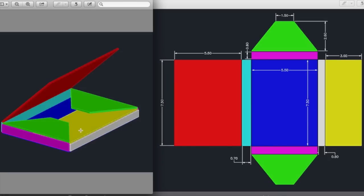There are a couple of things to keep in mind: you want the different lids to sit on top of each other when closed. The yellow lid is lowest, the green ones fold over on top of it, and the red lid folds down on top of everything. To do that, the side panels must be the correct height. The gray side panel is the lowest at half an inch, the magenta panel is slightly higher at 0.6 inches so the green panels sit on top, and the cyan panel in the back holds the lid.